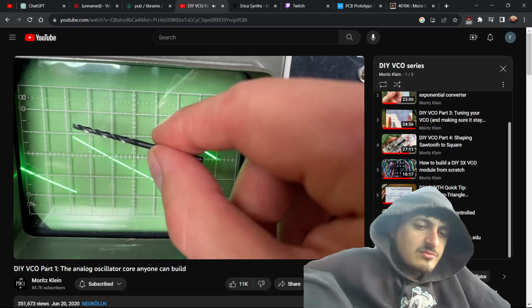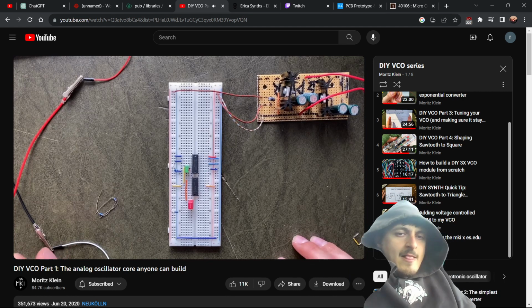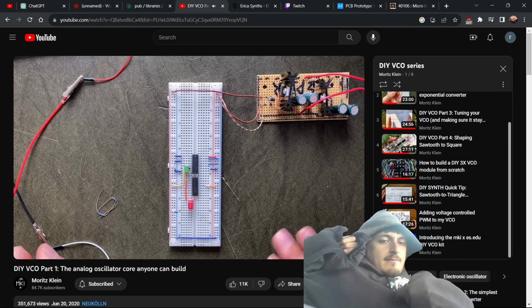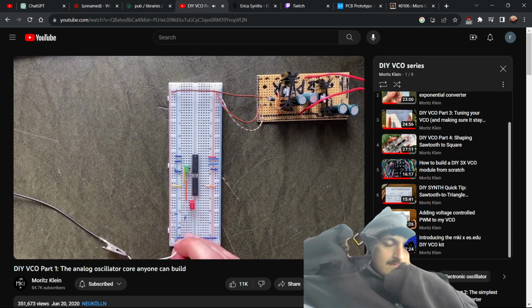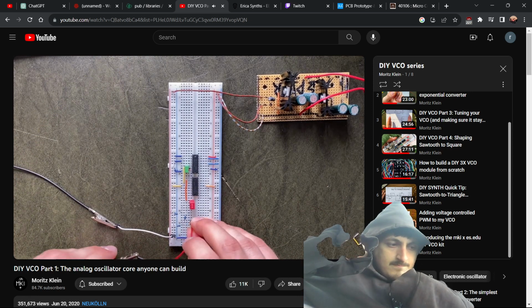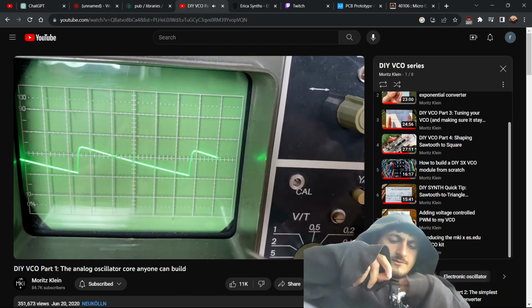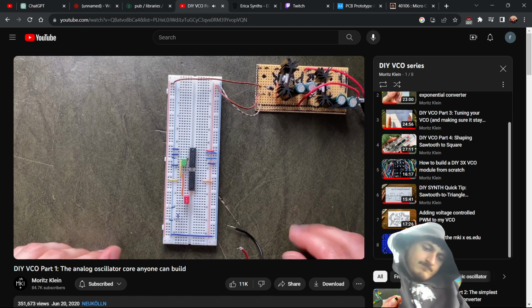So we could say that it has a height of 3 squares. And now I'll set up our voltage divider with 2 100K ohm resistors. And I'm expecting to see the size of that oscillation to be cut down by half. Yeah, that looks about right. Now the oscillation is about 1.5 squares high. So now we're finally good to connect this to an amp.